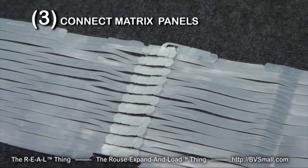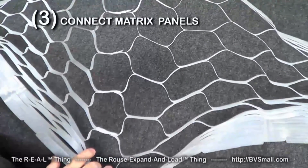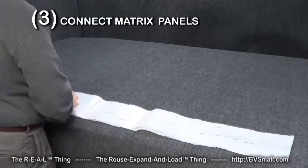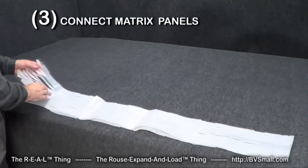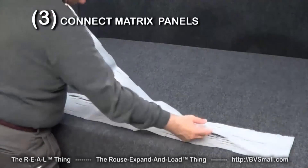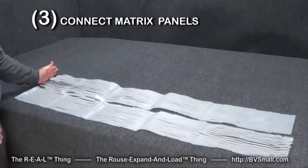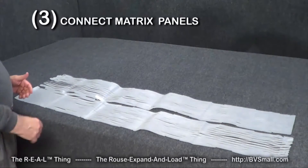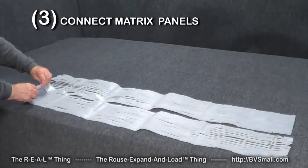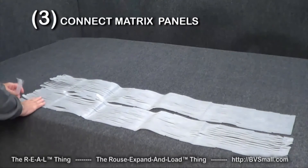When they open up, they open up with the same pattern as all the openings around them. Now I've moved back to our starting position with the two panels, one on top of the other, with the logo cut out in the upper left-hand corner. Only this time, instead of connecting them end to end, we're going to connect one above the other. You'll lay them out so the edges at both ends are even. We're going to pull the carrier tabs on the other end — fold it over a couple of times to loosen it up, put one hand down, pull, and you have it off. Do the same thing on the other end.